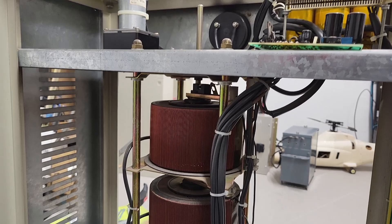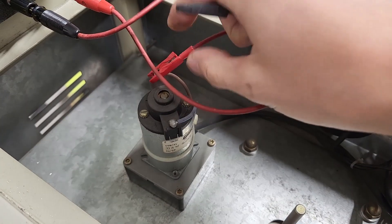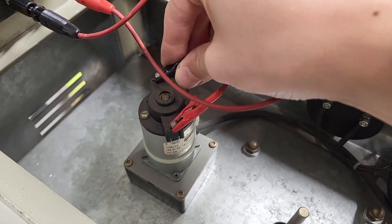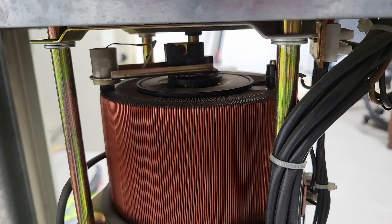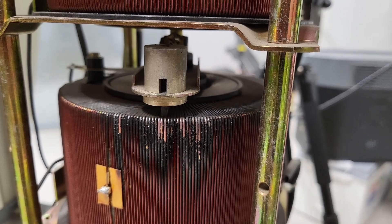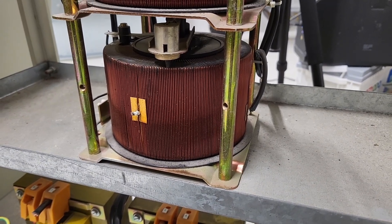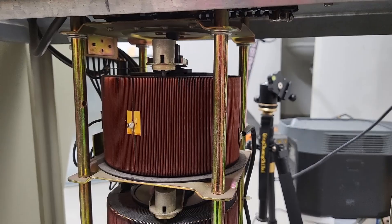How cool was that — the sliders all moved at once right to the end of the track! I reverse the motor polarity to send it in the opposite direction, and unfortunately right around the burnt part of the winding, the slider stutters as it moves. So this middle variac is probably beyond repair. Luckily the other two don't show major signs of damage, so I may still be able to use those.